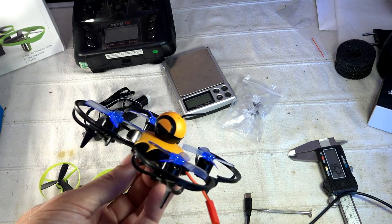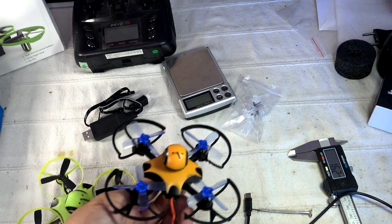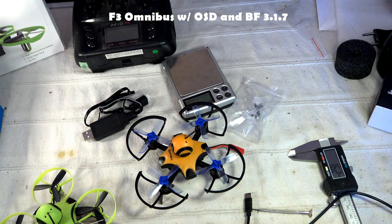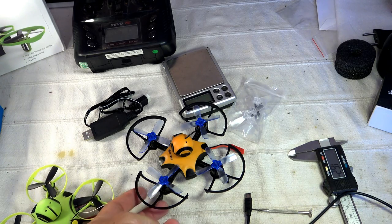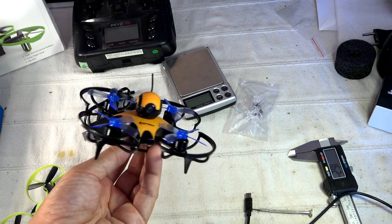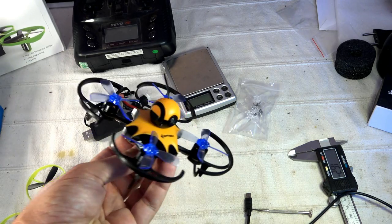In terms of OS, we have, as I said, the last Betaflight, and good point, everything is configured. You have some optimized PID settings, some optimized OSD layout placement, more or less optimized, almost perfect, and the LEDs are also programmable. But as you can see, some little optimization can be done, especially in terms of frequency, loops, etc., and optimize the LEDs a little bit better.